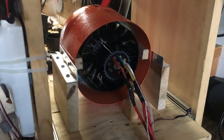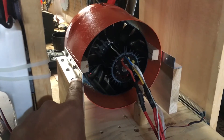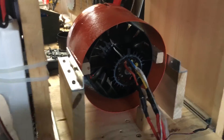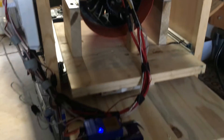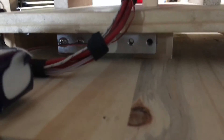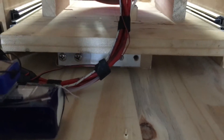To the back of the fan here, we can see how it's mounted. Basically just using some aluminum brackets to hold it in place — I've got three screws on both sides for a total of six, so that fan is nice and secure. My receiver battery is set up right here, and down beneath the test bench, that's what's giving us the thrust measurement.